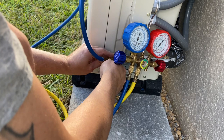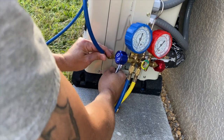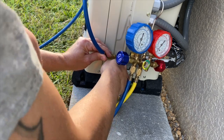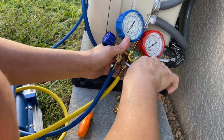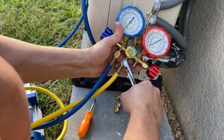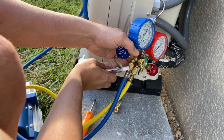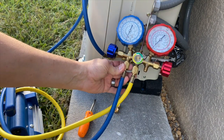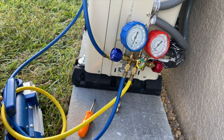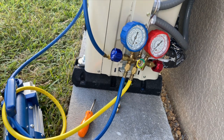This connection seems a little loose too — that would definitely do it. So I'm going to start with making sure all my connections are snug. I don't know how I left them loose but apparently I did. Even this one's not so tight. So that's the first place to start: make sure your connections are snug. I'm going to tighten everything and then let it run for another half an hour since apparently I let it leak through the connections.